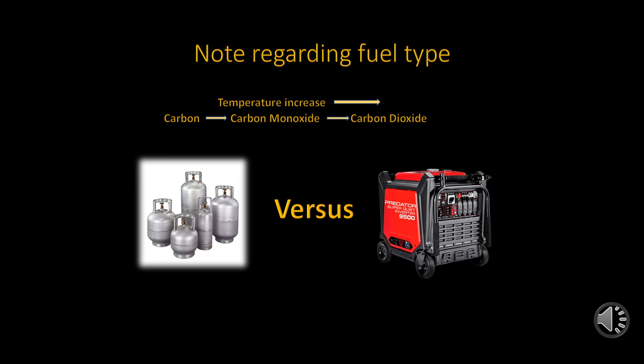Electricity is much cleaner and therefore preferred for the home laboratory or the commercial lab. Gas fired furnaces are equipped with electronic control units, but some portable units will not have this feature, and therefore temperature and airflow will not be accurately controlled. It is always recommended these days to purchase one that is electrically controlled. This may become a problem regarding portable units — an inverter generator of a suitable size will be required for the field. Regular generators deliver dirty power, which can destroy the sensitive electronics used to control the furnace temperature.